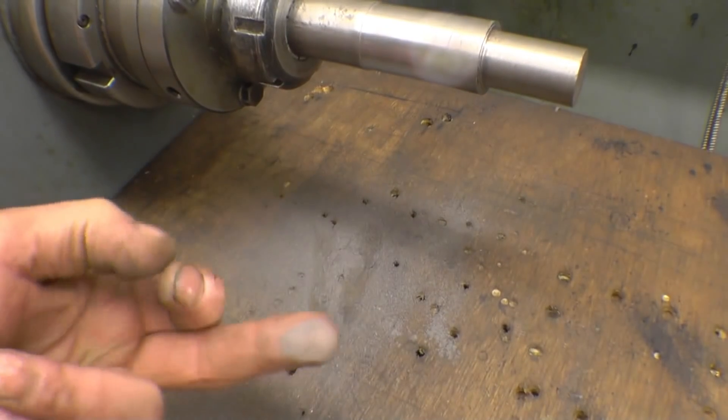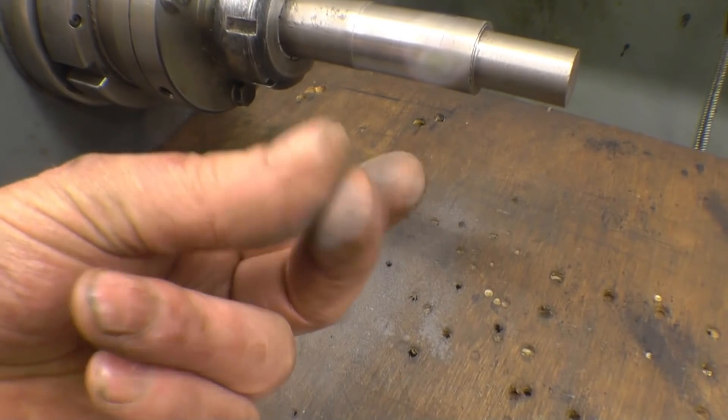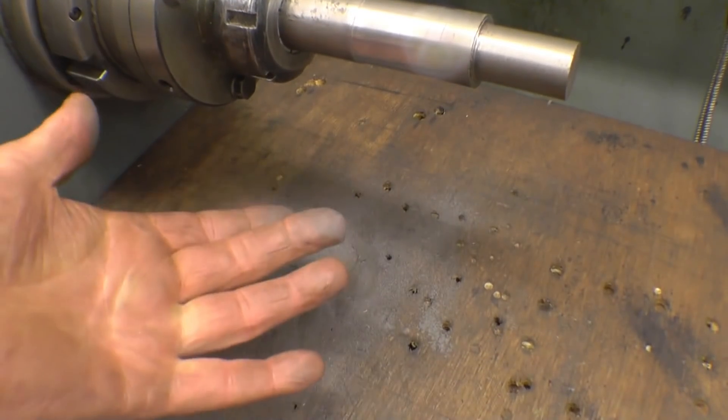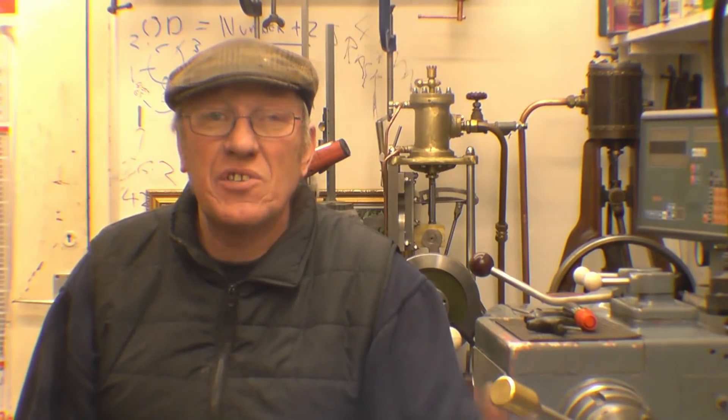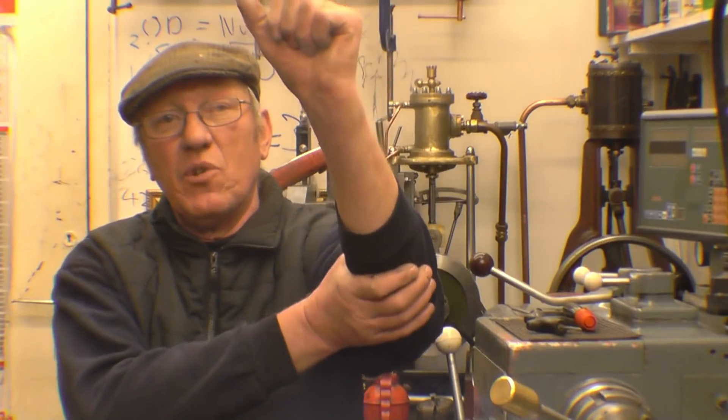I mentioned the dust — that's the grinding dust. You don't want that mixed up with the oil on your lathe bed, because it makes perfect grinding paste. Right, I don't see what else I can possibly do to test Emery Tape. It does what it's supposed to do — it removes metal. Would I buy this for my shop? Absolutely. I think it's a good way of buying an assorted pack of Emery Tape. You get the four grits that you use all the time in one handy little convenient box — they also do bigger packs. Anyway, I hope you enjoyed the video. Thanks for watching. Don't forget, stay safe on your lathe. Keep them shirt sleeves away. No jewellery, no dangly bits. Thanks for watching.